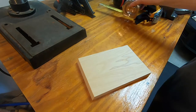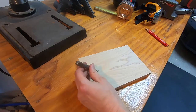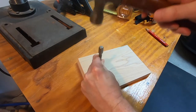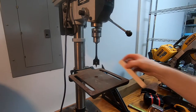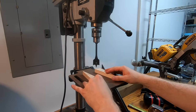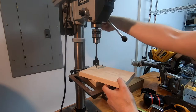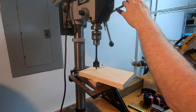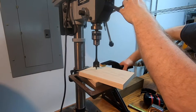being close to the top, gives the birds some protection with the roof above, and also keeps the space inside the birdhouse available below them. But here I'm setting up the drill press with a 1 1/4 inch bit so that it will be elevated and not hit the base of the drill.